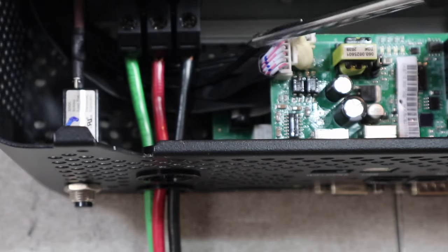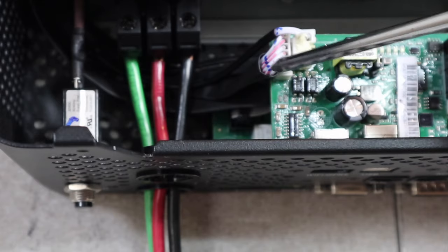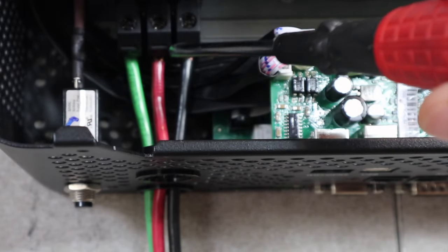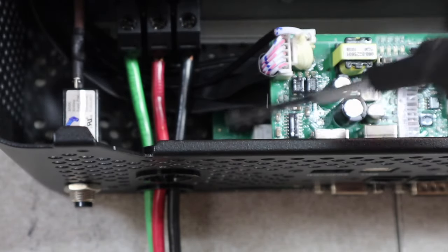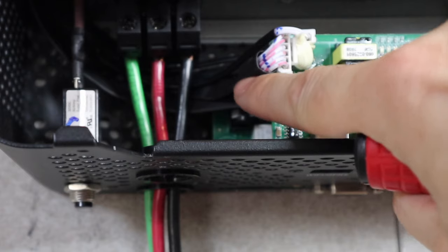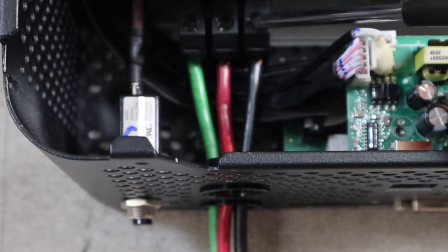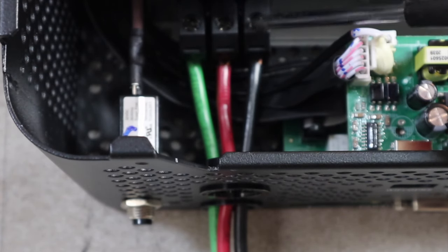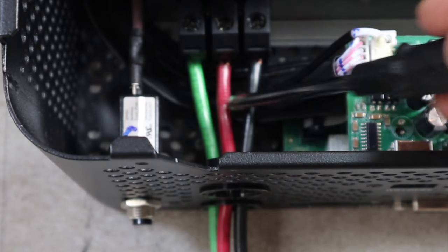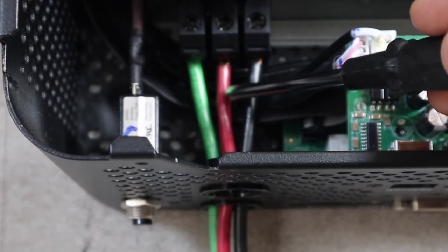The only thing I don't like about these Growatts so far is that the wiring harness in front is strained. I really had to push it back to get the wires in the AC output in the back, and it could be a little bit longer. Just remember — we've got our ground, our line, and our neutral as labeled. This is line one and line two — line one is red, line two I put black. You can use whatever colors you want here, just keep everything consistent so you don't get a short circuit.